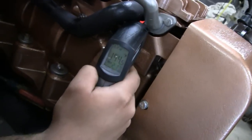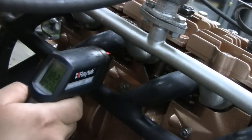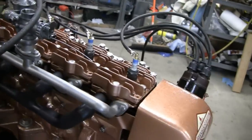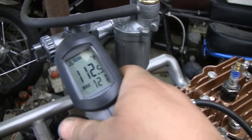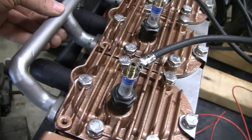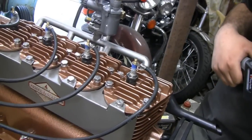Looking at 194, 195 on the cylinders — that's plenty cool. About 196 — they're all about the same, all under 200 degrees. I was hitting the exhaust on the last one — about 190. There you go, Tubes — everybody was concerned. The carburetor was worried about not being able to fuel all four cylinders — seems to do all right. They were worried about the cooling — this thing's cooler than a regular engine. The intake has passed a little bit of heat, but it's gonna happen — it comes right above the head. I used regular epoxy on that, so I didn't think it would get that hot, but it seems to be okay. We'll see what happens.